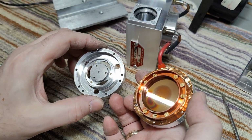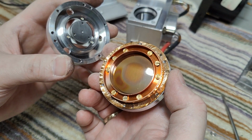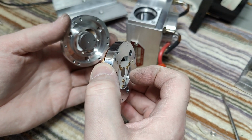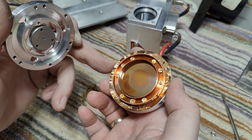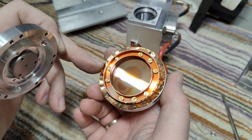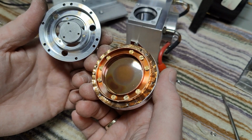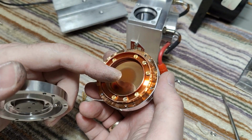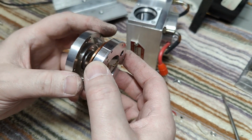It is getting more and more interesting. But now it makes a lot of sense. Remember, I said there's a connection on this side and on the bottom side here, right? And in the middle, there is this little membrane made of the thinnest little something that is conductive, probably like a copper foil or something like that. And this looks exactly like a capacitor, a condenser microphone. If you've ever taken any of these apart, you'll see there's a membrane and then there's a contact. And see, when this one moves, this system can measure this.